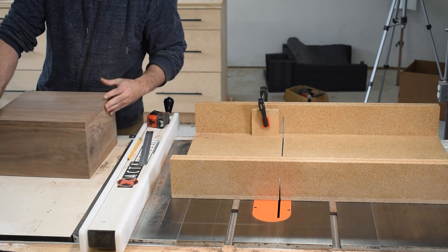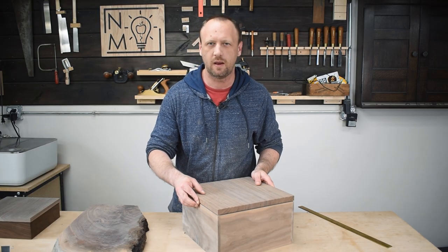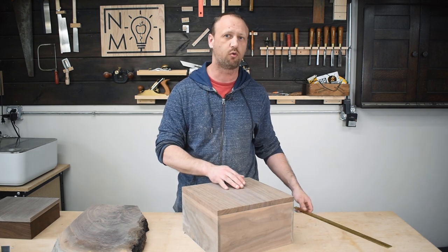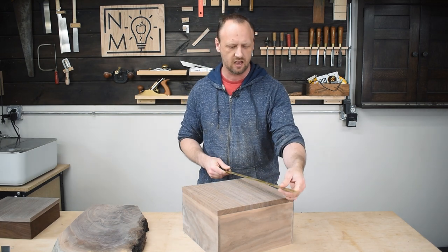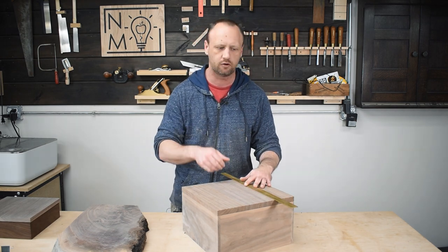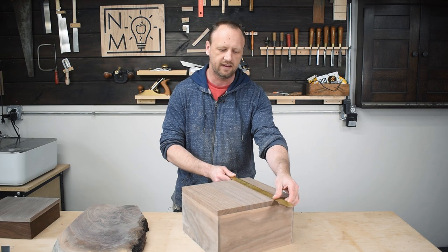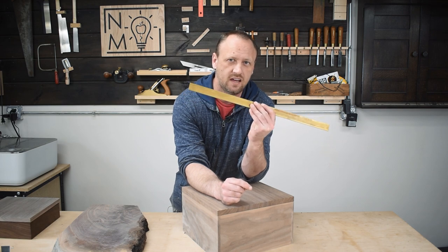The lid fits great and it has a little bit of wiggle room so that if there is any sort of expansion and contraction, it'll still fit and we won't have to worry about it splitting. The box looks fantastic the way it is, but there's going to be one more thing — we're going to put a brass inlay. I have this thick piece of one-eighth inch thick brass, and we are going to put that as a stripe into the lid. It's going to give it more of a modern look. To do that, we need to cut a groove into our lid to house the brass, then sand it all down, and also do a little bit of prep work on the brass to make it stay in the wood.